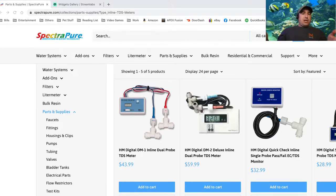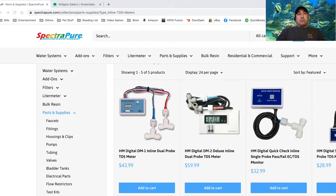Typically, you replace your carbon filter every 2 years. Generally, you don't have to replace those very often. Sediment, you'll know when it's time to replace it. The thing will look terrible. Membranes, the only way to know when to replace them is, like I said, if you're getting any type of TDS out of the membranes.